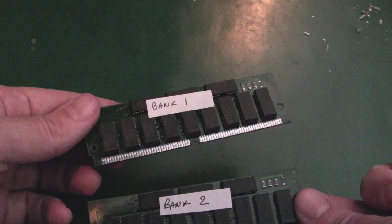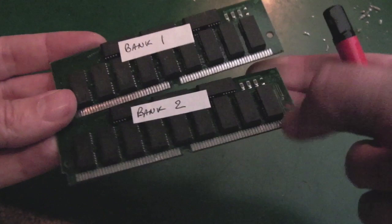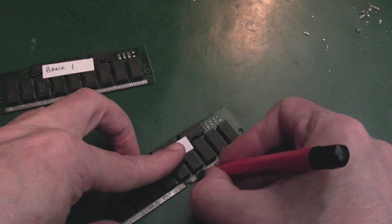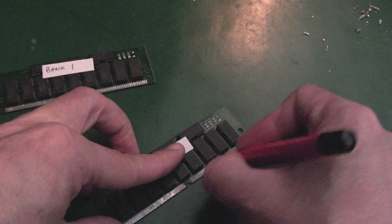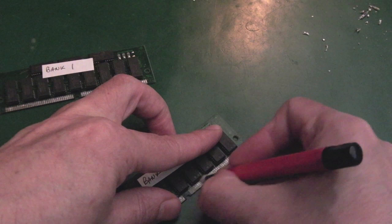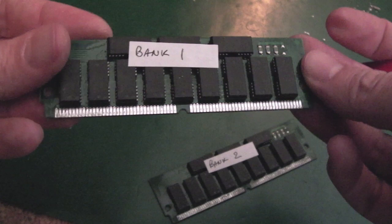Now, this was as corroded as that, can you see? Look at this side here, I started to clean that side. Yeah, hopefully you can see that. Look how dull and green those pins are. So yeah, I think this is the problem. These are going to need cleaning up for sure. Those are awful, absolutely awful. I'll wipe them with some vinegar in a minute. This is like solder coat, they're not gold plated or anything, so we can just use a bit of friction here. But it might be bad connections, despite the fact I cleaned that one and retested it. Some of them are still looking a bit questionable, so it could just be dirty contacts there.